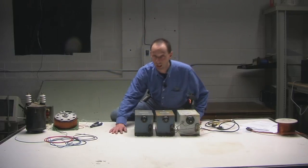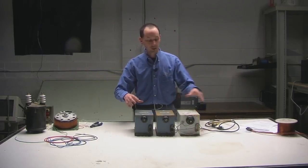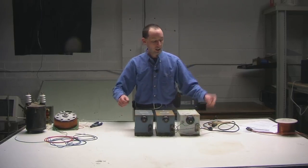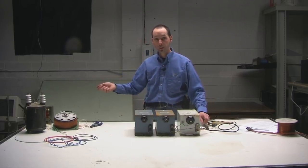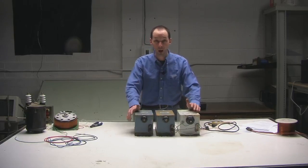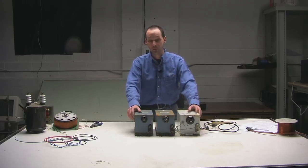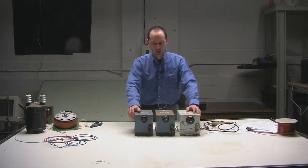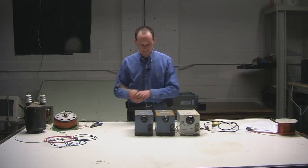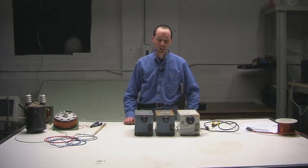And if you're really good, you can actually have one plug that goes to the first bank of three or four, another separate plug off another separate circuit going to another bank, and you could have pole pig power with NSTs. It can be done. People have done it. The biggest I've ever done, I think, was 7. We had, back around 2001, 7 of these in a row. But that's the basics of it. That's how to phase NSTs.